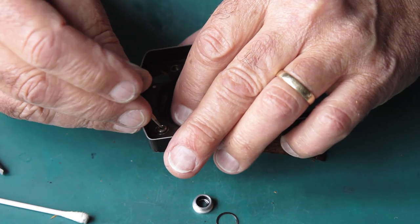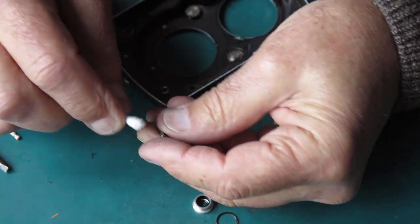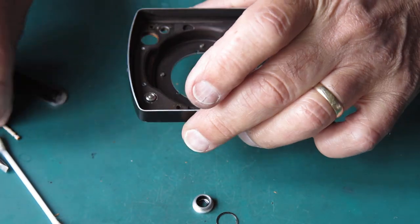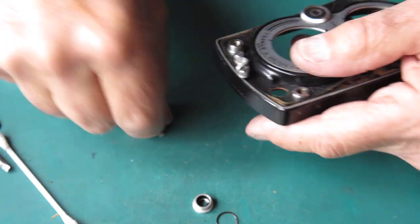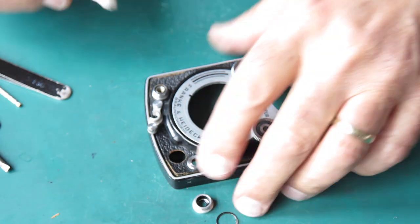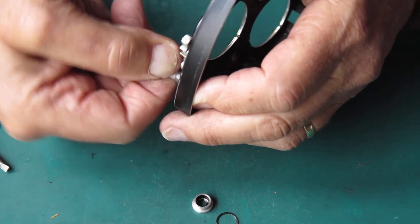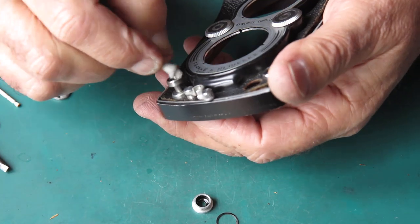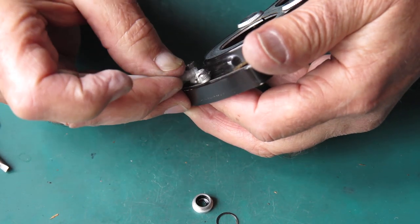The pin that sticks out of your cable release would press on the pin in here and press the release on the shutter mechanism. And of course that pin is sticky. It didn't fall out — I've got no special reason to believe it would have moved smoothly with the cable release either. It's certainly moving nicely now — that just fell out, which is how it should have worked. There should have been no friction there at all, no measurable friction. I'm going to clean that socket — that's where the cable release would screw in — just to remove that grime, because dust that settles down in there would effectively make the action stiff.